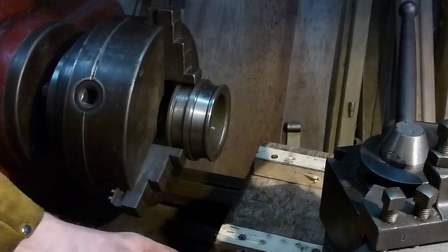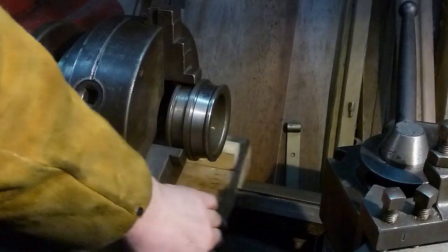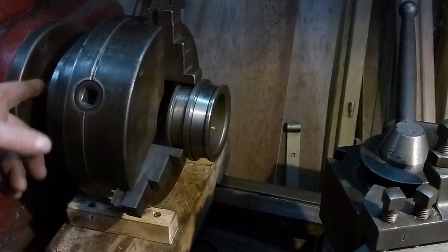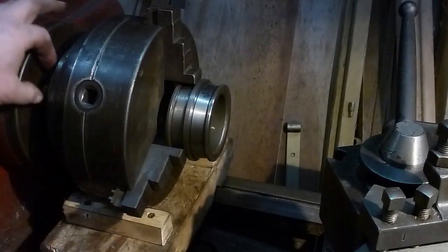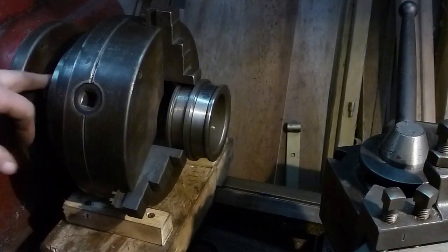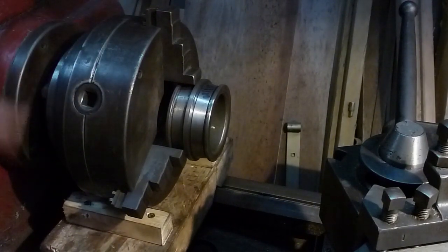If you've got a heavy chuck like this, use a block of wood — but also use a block of wood that's at a height that will carry it into position. On this particular chuck, which is a bolt-on Edric chuck, if you can just slide it into position and put the nuts on it, it is nearly as quick as a quick-release system. With Edric chucks, make sure the stud is not long enough to stop you taking the nut off when you're completely in position — that will make it easier to change.